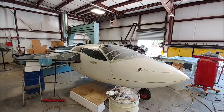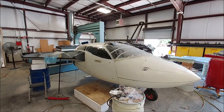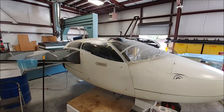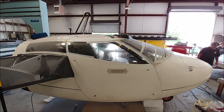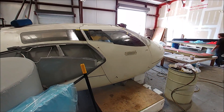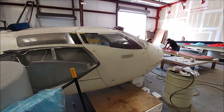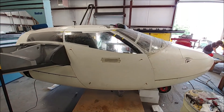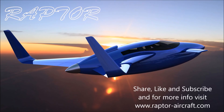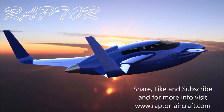Unfortunately my window ended up slightly out of alignment. I wanted a 3mm gap on the front and 3mm on the back, but I got about 3mm at the bottom on the front and about 2-and-a-bit on the top, and about 4mm at the back — so it's a little wider at the back. It's noticeable, but I'll do a better job on the left-hand side now that I can Monday-morning-quarterback and figure out a better alignment method. Overall we're getting close to finishing the doors — tune in next week: I'll be working more on the doors, Jeff on spars, Jim on rigging and landing gear.